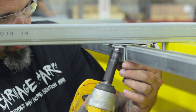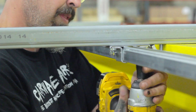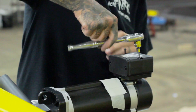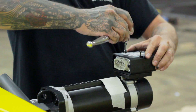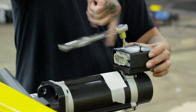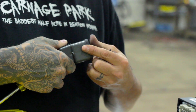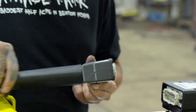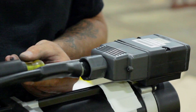When done, securely tighten the brackets. Next, we are going to plug the hoist motor conduit into the bridge traveling machinery. It may be necessary to rotate the head of the bridge traveling machinery to better accommodate the conduit. To plug the conduit in, first attach a rubber gasket to the rim of the connector, then simply plug it in and tighten the screws to secure it.